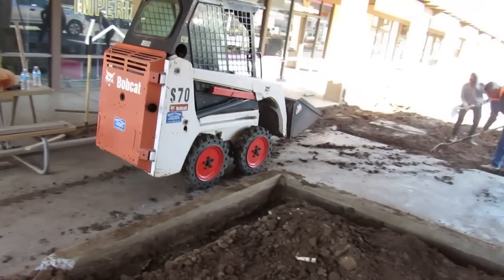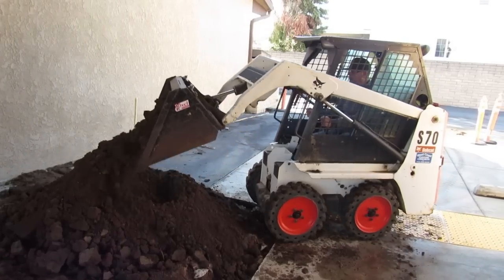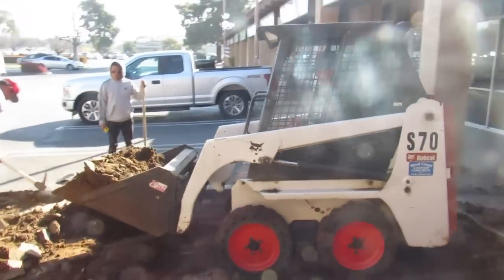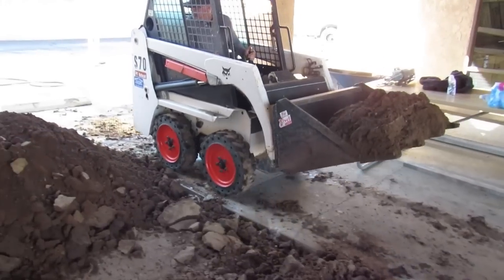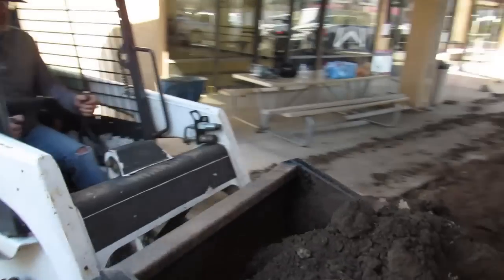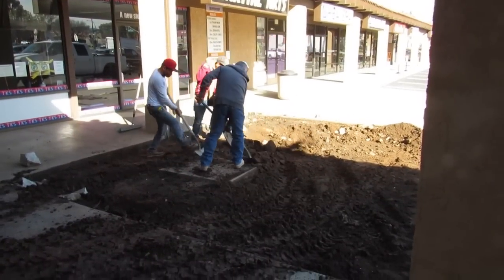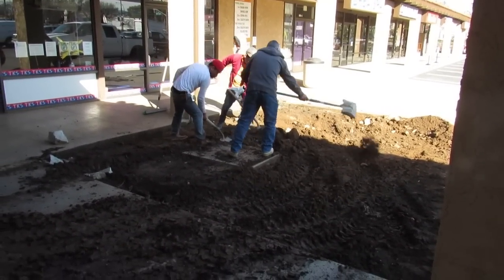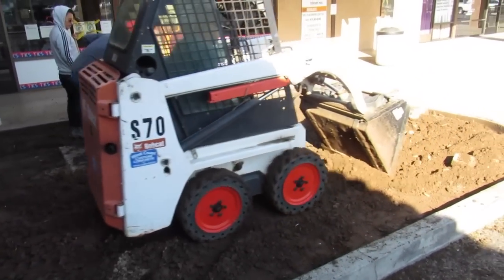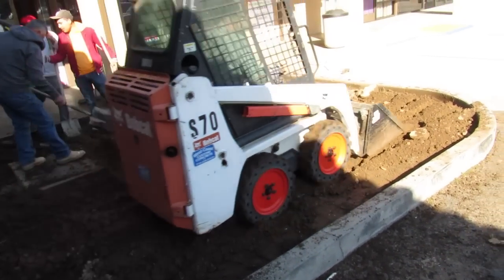The problem with this slab right here, you'll see when we pour it, the curb and the sidewalk were dead level because they didn't anticipate somebody filling it with concrete and putting in a seating bench and all that. So right where the downspout off the roof comes, we put a little swale where the water runs out. The next day I showed up, it was raining, and I have it on video that there was no standing water on it, but it was dead level, the curb and the sidewalk, and that curb was staying. So we weren't taking this curb out where Javier is. And then we left about 8 inches. We boxed it out with forms so they can put plants around that Edison box or whatever they want to put up, and Edison has access to it if they have to lower it.